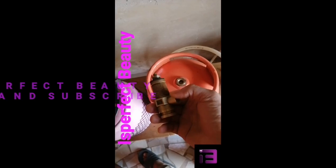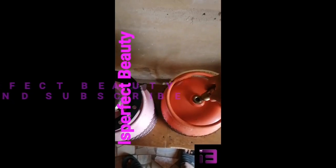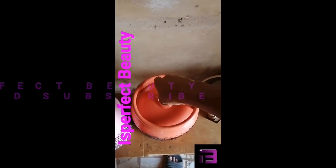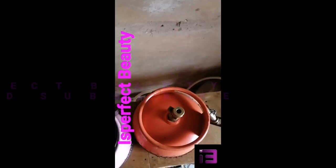But when you are transferring from smaller cylinders, for example 6 kg, 3 kg like this, you will need this. So for 12 kg you skip this process, but for 6 kg and 3 kg or cylinders with this type of head, you need this. So all you do is fix one of these to one of the cylinders like this. Then you fix the second one to the other cylinder like this.